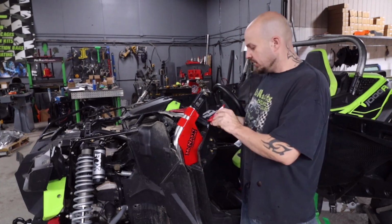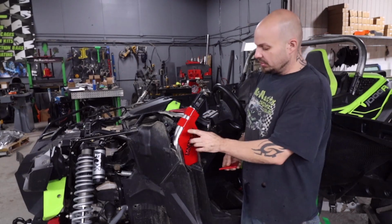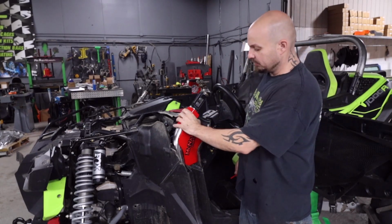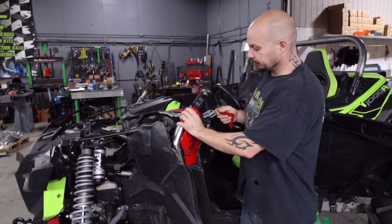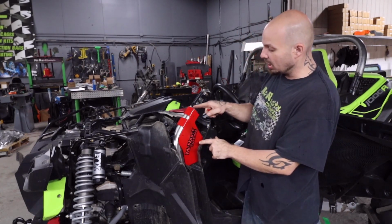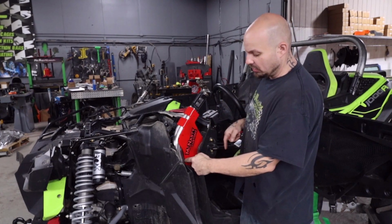We'll put it in the corner, and you can see that. So you'll get the 2 inner gussets and the 2 outer gussets. Look how easy that is to put into place. So what you do is you slide it in. You'll come around the top, weld it in all the holes, all the areas on the edge, open areas. You weld it all the way down.